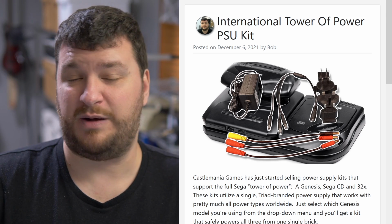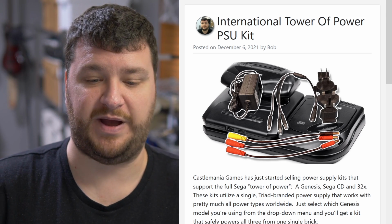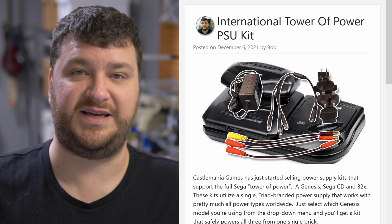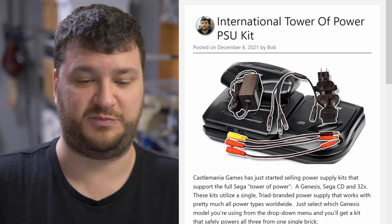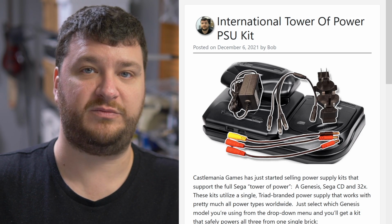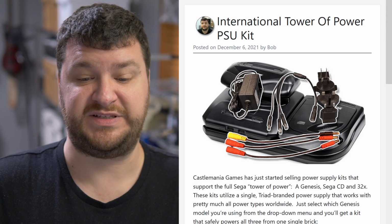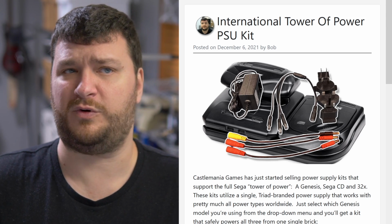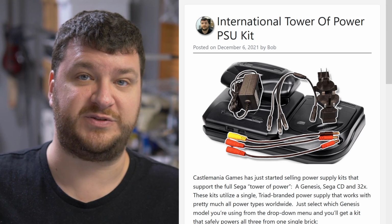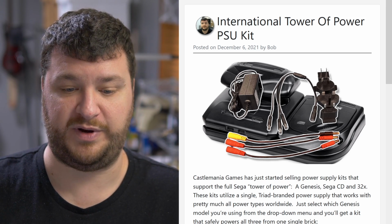And while it probably wouldn't cause any harm, I would rather be safer when it comes to power. But like I started out saying, since the Genesis, 32X, and Sega CD all share each other's grounds a bunch of different ways anyway, moving to one PSU could only improve it or make it exactly the same. And the scenario in which it would improve is if one of the 3 power supplies is failing, or if one of them's a cheap knockoff third party, you might actually get a boost in performance with this because you have one quality power supply powering all 3.